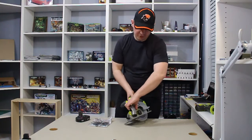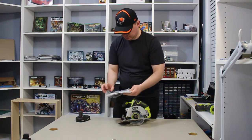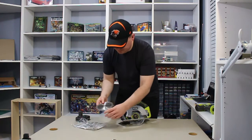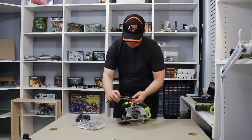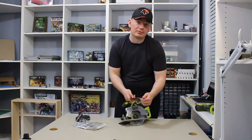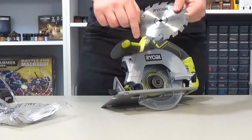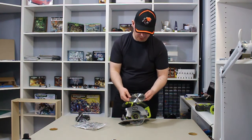When you're changing the blade, I might as well put the blade on now — it's a how-to at the same time. Here is my blade. On the blade you can see Ryobi. This one is a 5 and a half inch blade with 18 teeth. So if you are cutting 2x4s or any kind of rough pieces of wood, this would do fine.